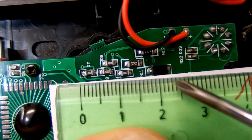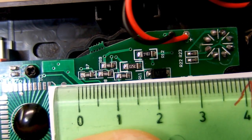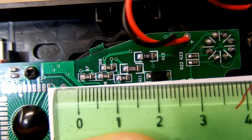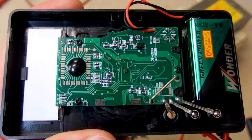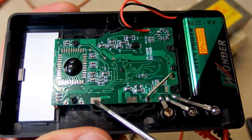Let's take a look at what actually handles the input voltage. Those tiny SMD resistors handle up to 1000 volts DC or 750 volts AC, and as you can see there is absolutely no fuse — there is just an empty space for it.